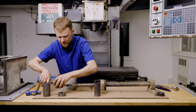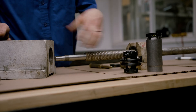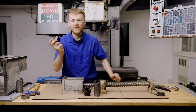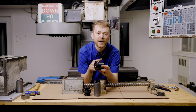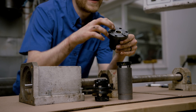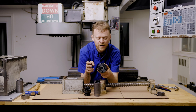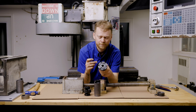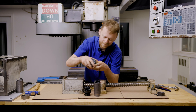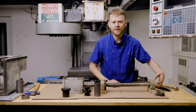Let's talk about how this sits in the machine. This sits in the machine like that. This is your thrust bearing. There are two angular contact bearings inside of here, and the preload is set at the factory when they tighten this inside. I have twice successfully unscrewed these and replaced the angular contact bearings — pain in the neck. I had to heat the thing up and build a tool. I just think it's not really worth the effort.